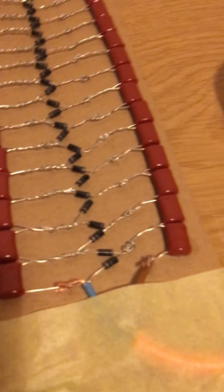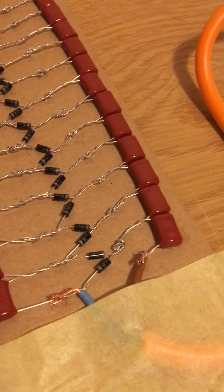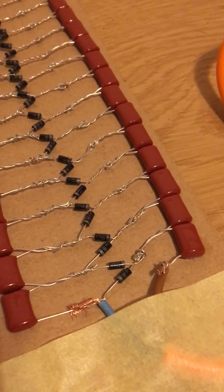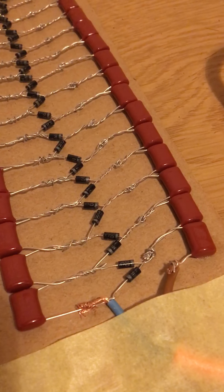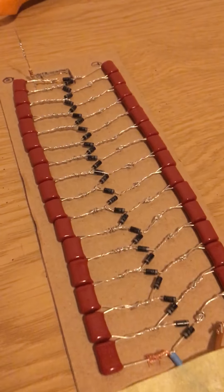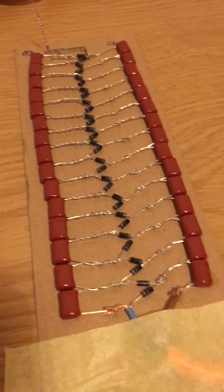If you wanted to, you could put a resistor across the live and neutral and run a neon bulb indicator to show you it's working, but I'd rather not — it's just something else that could go wrong, and neon bulbs have the tendency to burn out. I'm happy with that; I'm going to buy a project box, mount it inside there, and hopefully it'll give me plenty of fresh and cleaned air for many years.